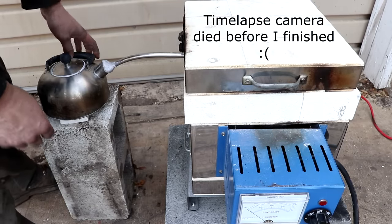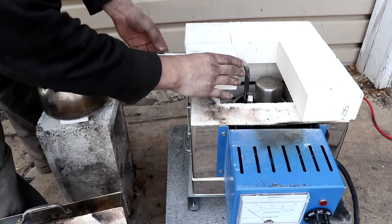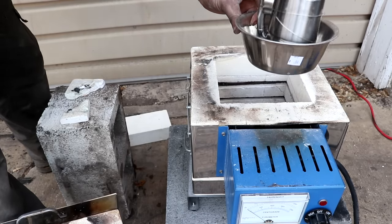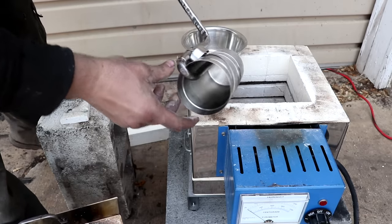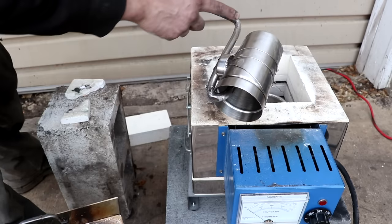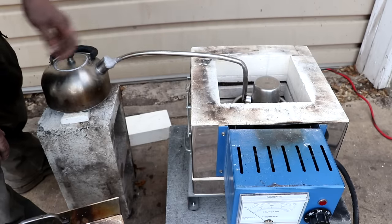So this is what I've come up with. You see the kettle here. And if I pull the furnace apart — you see how I did that — I had some spare fire brick and just cut to fit everything. Here is the reaction vessel itself. There's another stainless steel dish that goes here. The tube just bends up and goes into the top of this. To bend this tubing as sharp as I did, I ended up filling it with tin and that keeps it from collapsing. It wasn't easy to bend, but I was able to do it. So let's just load it up now.